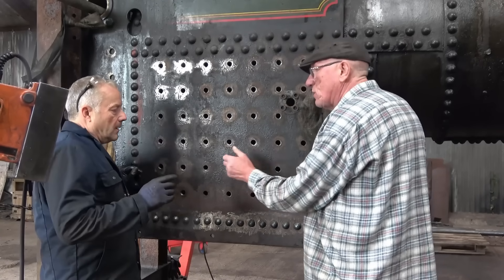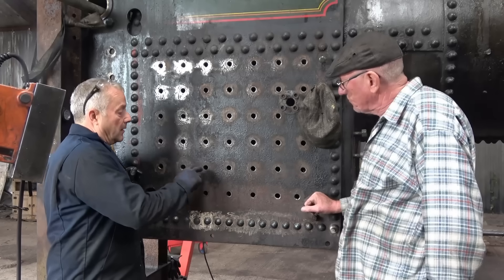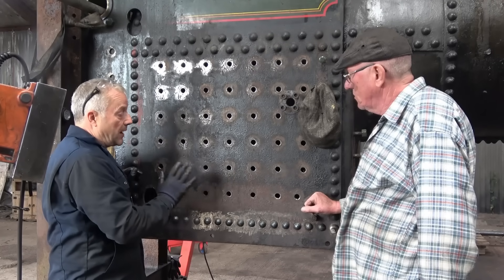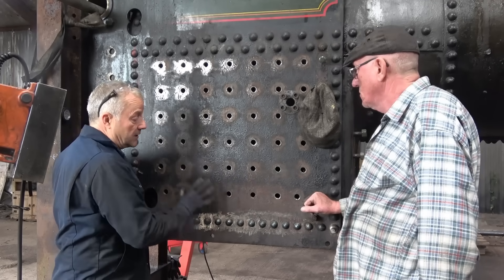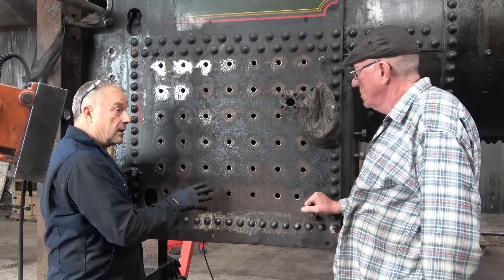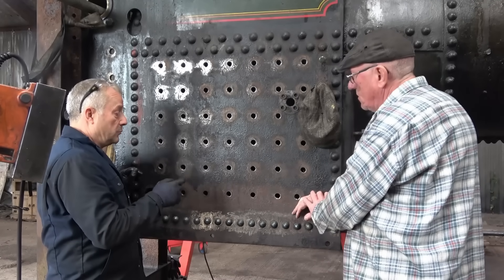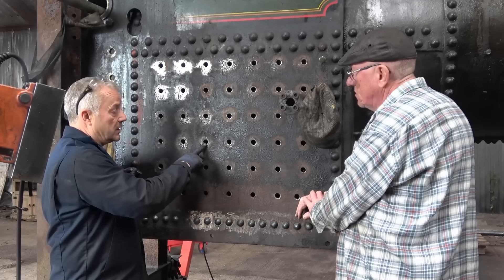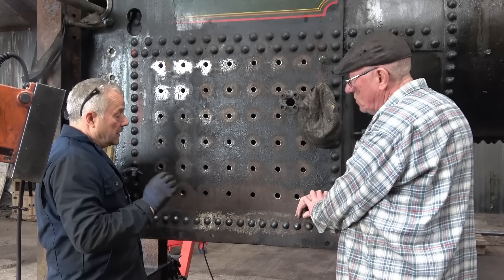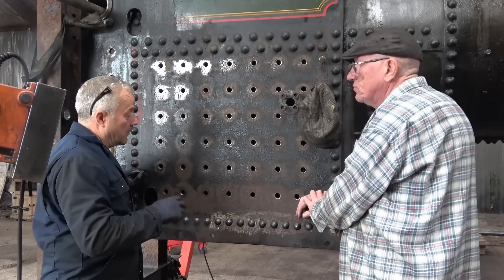It's a brand new firebox inside so there's no holes in the firebox. When I took the old firebox out, I ground all of these off and managed to wind them out. We've got six to do today. These threads might have been okay, but a lot of the rest of them were knackered. So we took them up - we're taking them up to the new size, which is 10 threads per inch. It's a strange thread. In essence what we're going to do is drill through these and then thread them.